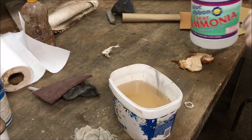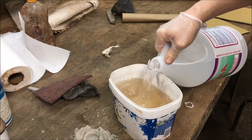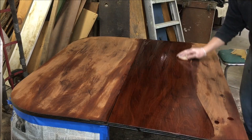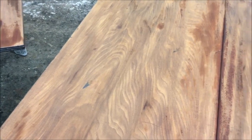After finishing up with the 120 grit, I went ahead and wet it down to raise the grain. I'm seeing some dark spots, some dark areas. So what I'm going to do is an ammonia treatment — that's going to darken up the mahogany. I'm going to dilute some ammonia; I don't want to go full strength or the wood will turn almost black. After the first treatment I wasn't quite satisfied with how dark it got, so I did a second treatment just a little bit stronger, and I like the results.